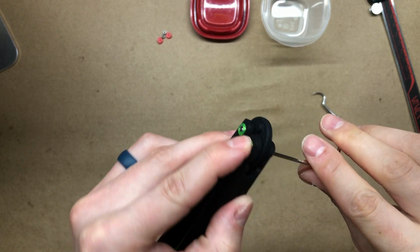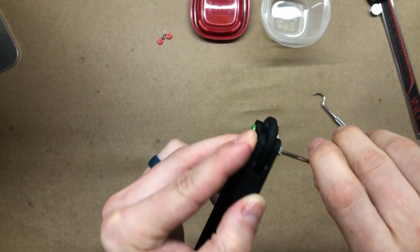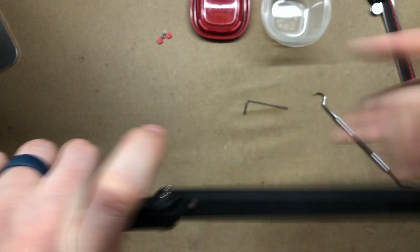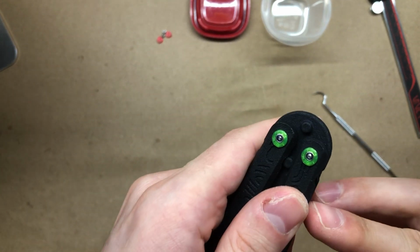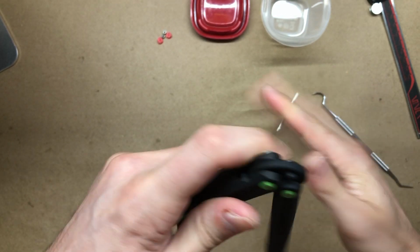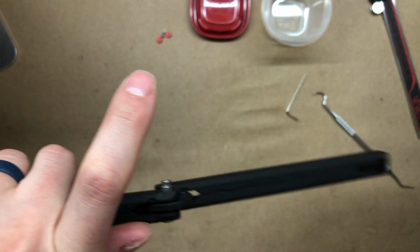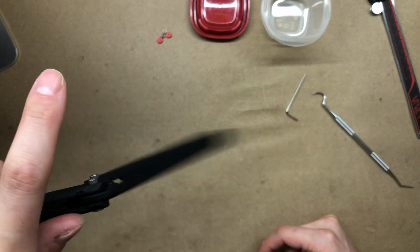You may need to apply some friction on the hex nut here. You can see I'm doing that with my finger. And I'm just going to retighten until I feel a resistance, a medium resistance. I would not consider this a free handle swing. I'm feeling some resistance. You can see I over tightened it a little bit, so I'm going to loosen it a bit and then repeat that test. That feels a lot nicer. Very smooth swing. I'm just going to do this a few times to distribute the lubricant around the bearings and the race washers.